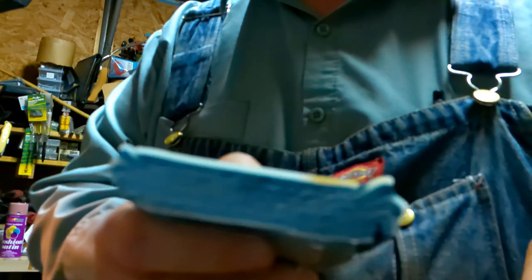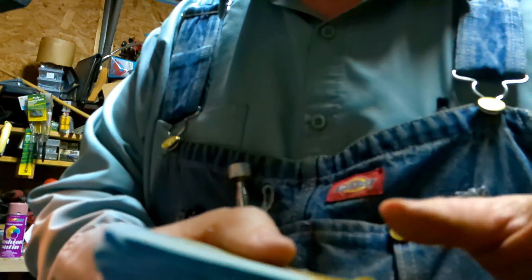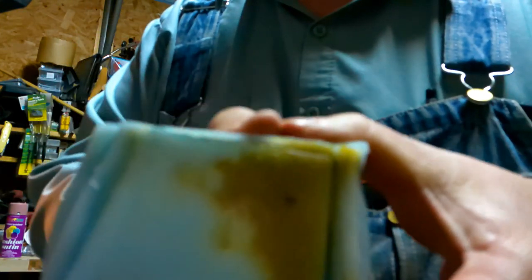Okay, now we want to see if this will delaminate. I've got a lot of questions. Will this delaminate if you mill down into this part? Will it chip out? And I want to know that too. I want to know, will it hold up if I cut down into these laminates? And that will let me know if this will allow me to do that. So I'm going to set it up over here now that we got these two nice sides that are parallel. I can put it here in my vise and put this thing in there and mill down. I'll try and mill down to where I'm kind of in between levels to make sure that it's all stuck together. So let's do that now.